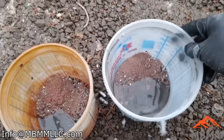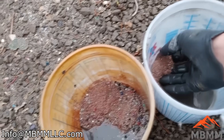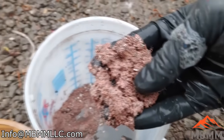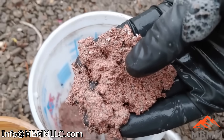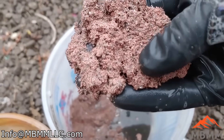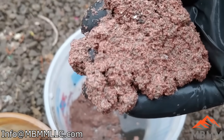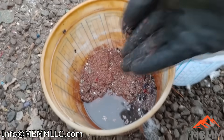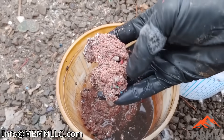Here's our number one and number two. This is from the pre-screened fraction, right out of the granulator. It's pretty much pure copper. There's some tinned wire in there — that's the lighter gray stuff — and then obviously the copper hair wire. So that's the number one. The number two actually had quite a bit more in it than the number one, and there's a little bit of contamination — you can see there's a little bit of aluminum flakes and a little bit of red insulation.